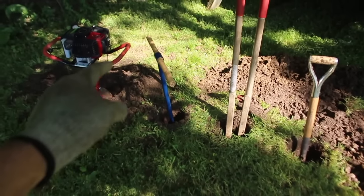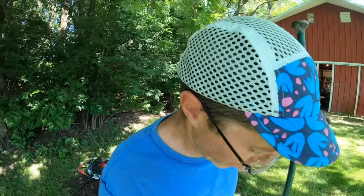Before I give my final judgment on those four holes, let me point out that I almost always bring one of these with me when digging post holes — a big old rock bar, over six feet tall, solid steel, probably weighs 20 pounds. The reason I bring it is that all of these methods have limitations when you hit rocks and really hard ground. In particular, the power auger just can't do anything with really compacted clay, stones, or roots. I find that if I'm using the power auger, I almost always have to go in and start chopping with this bad boy. If you're going to be digging a lot of holes, bring one of these — it'll cut through just about anything straight down, better than a pick because it'll go a lot deeper.